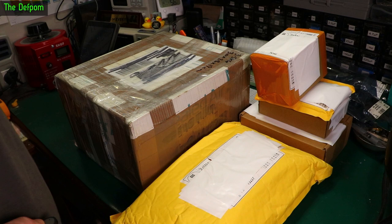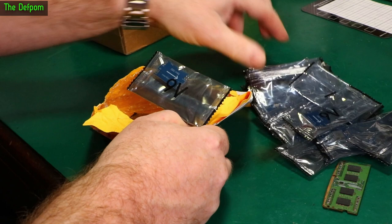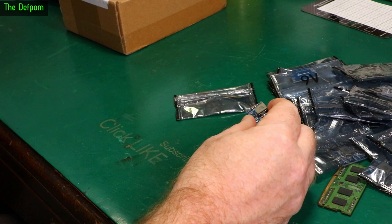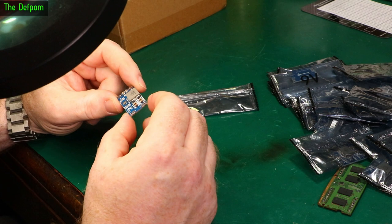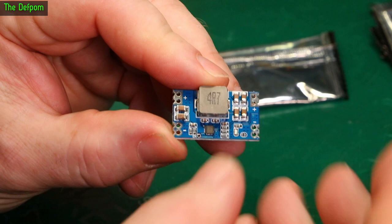See what's in here. There's a lot of these — what is this thing? I think I know what this is. The chip marker's been lasered off so they don't tell you what's actually on the board. This is a DCDC step down. It's always got marks on the back there. You can see that chip there's been lasered off — don't want you to know what the chip is. I think it's the TP5100.